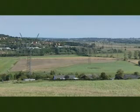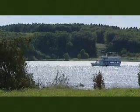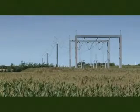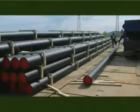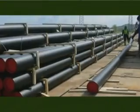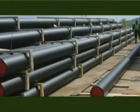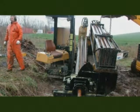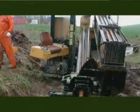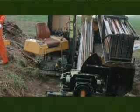Prior to the start of the excavation work, all line owners are contacted with a view to providing an overview of all crossing lines in the route. Some lines can be crossed through normal digging up, while in other instances, casing pipes are laid for the 400 kV cables in order to protect them from the work being performed. The laying of pipes also means that any crossing lines can be covered again prior to the laying of the cables. In connection with large sewers, water, gas or oil pipes, controlled directional drillings may be performed to cross the lines. The choice of crossing method is determined by the conditions at the individual sites.